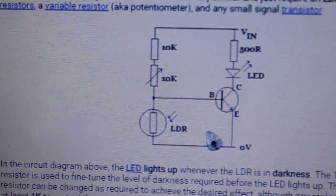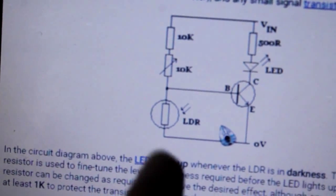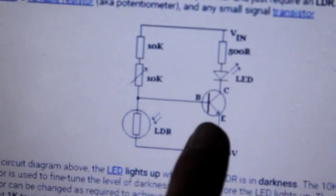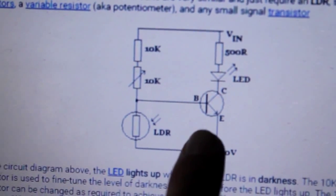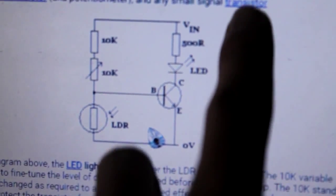Here's the schematic of the circuit. As you can see, you place the LDR on the lower side and add some resistors and a transistor. The transistor is the driving part of the relay. Here we connect the LED, and at the same time we connect the relay.